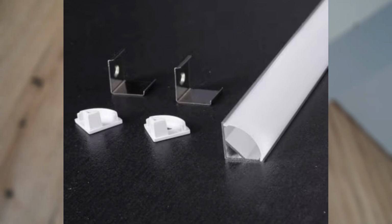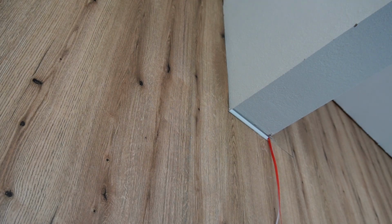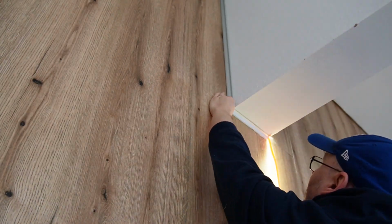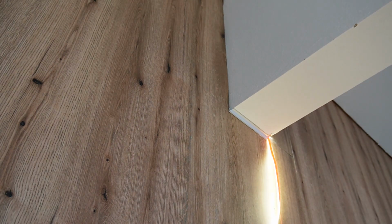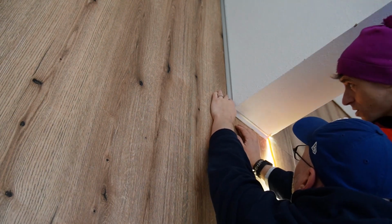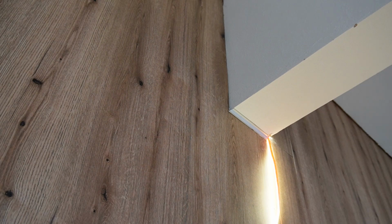It was quite tricky to do it here because the corners are not exactly perfect. Again, it's like a patio area, so it's not like everybody prepared to do it perfectly. So just installing the bottom at the beginning, and then going on the sides, on the left side, cutting it at 45 degrees, making sure everything fits, going slowly since we didn't have a lot of chance to experiment with it. I think at the end we were left with maybe half a meter of this aluminium channel, so yeah.